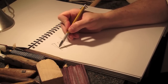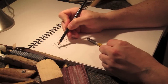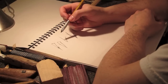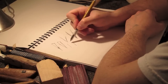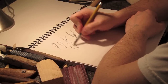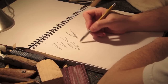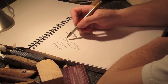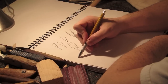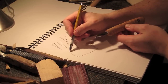Some knives have a bevel from the spine all the way to the back, and some have a flat spot — like Flexcut and Mora knives that have a little flat spot where the bevel starts. There's really no good or bad way; it depends on the size of the knife and your preference. Companies like Pfeil will make their gouges and chisels ready to use, but their knives won't be because they leave the bevel up to personal preference.